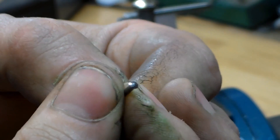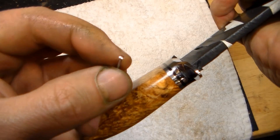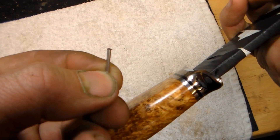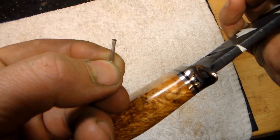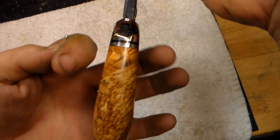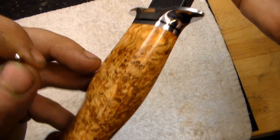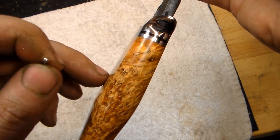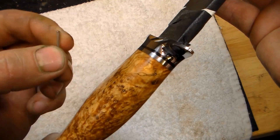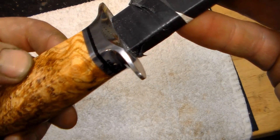Once we've got a head formed on that side, go over and buff it again. The head is mirror polished, but I've canted it over to one side intentionally. Most of my handles taper this way, and if the head were perfectly square, it would only make contact on the wider lower side and not on top. If we kick that head over just a little bit, that takes away the issue, and when positioned right, it should seat right up against the handle.